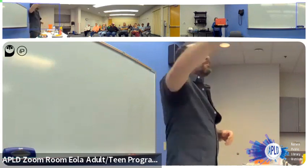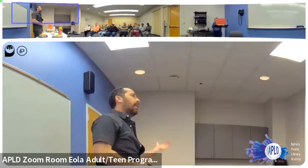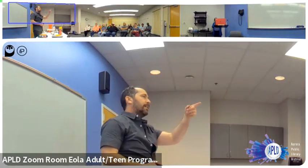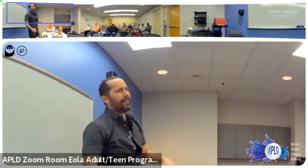I actually don't care. I would prefer you turn off at the breaker, not at the switch, because if the light has been wired reverse polarity, the light won't care. It'll go on and off. It'll do everything it's supposed to. But as soon as you do what I'm about to tell you to do, you might put yourself at risk. So I would prefer you to do it at the breaker. I don't care.